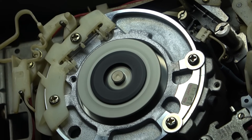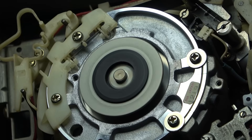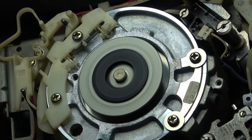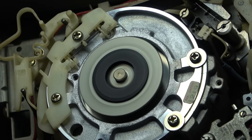The drum is losing lock — it's the drum servo. Every time that happens there are tracking bars. When I play with the tracking control, that doesn't make any difference, because the tracking control is changing the phase of the capstan servo. This has got a drum servo problem — maybe a capacitor that's gone bad. When I had the regular lights on, I have a magnetic ballast on fluorescent lights over my bench but I've also got LEDs running on DC with just a basic current limiter.